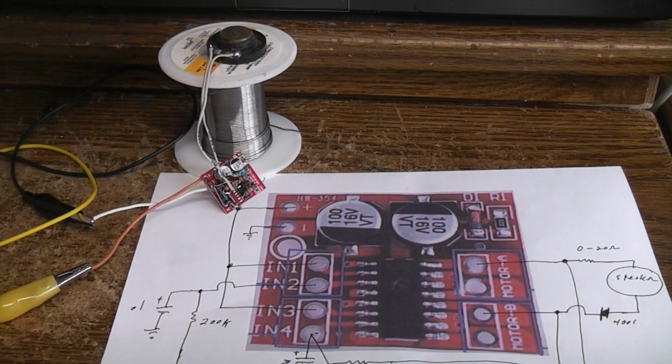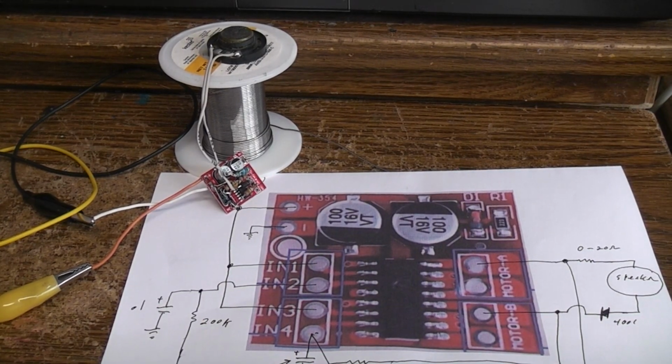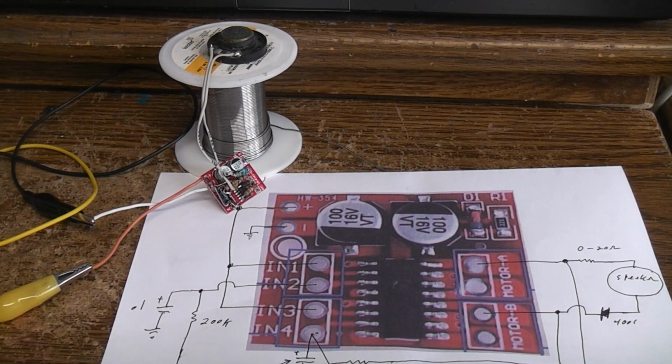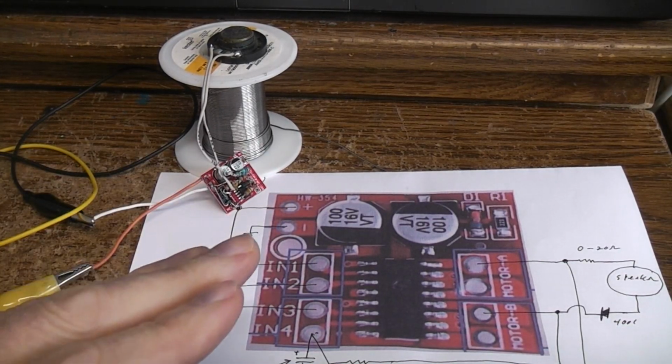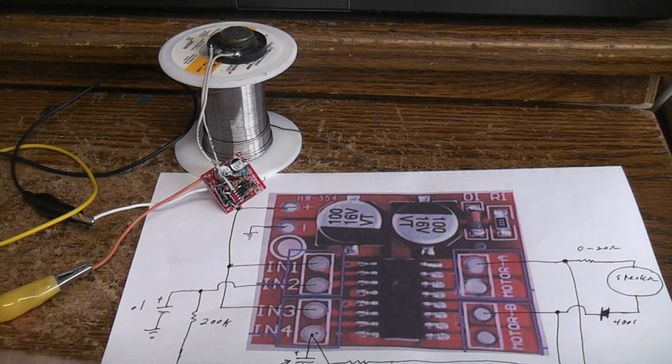There is a slight turn-on delay. I will turn the battery pack off to it here so you can see. I'm going to turn the pack on in 1, 2, 3, on. So as you can see, you got about a 4 or 5 second delay before the cap that does the beeping part, not the continuous tone, but the gating of the tone, charges up and starts cycling.